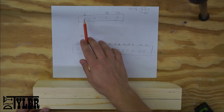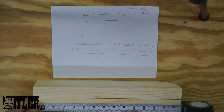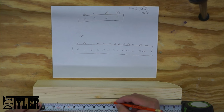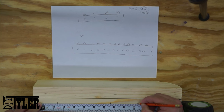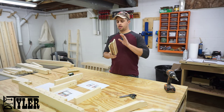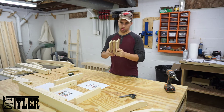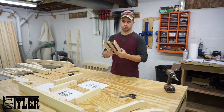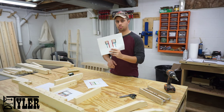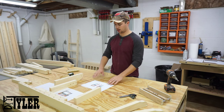I've done the math here as to what is the center of my dowel pins in these boards, so these measurements are to the center of the dowel pin — keep that in mind. To drill all of the dowel joinery I'm going to use my self-centering doweling jig. You can click a link up here or in the description to learn more about how it works. You can drill from both sides of this jig, which makes everything align very well. To keep track of everything I have my plans printed out and wrote down A and B side and the direction I want to drill.